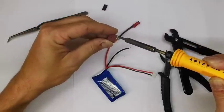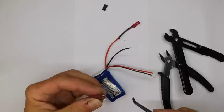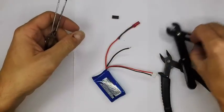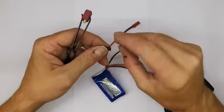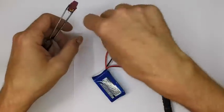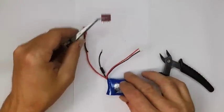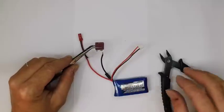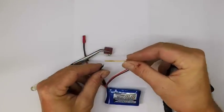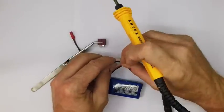Here's where your helping-hands tool comes in. I'm going to attach the negative first, and you'll need a little bit of heat shrink tubing. You cannot skimp on insulating with LiPo — or any pack. Heat shrink tubing starts fat and goes thin as it shrinks, hence the name. Slip a bit over the end before soldering. You cannot use hot glue, e-tape, or any substitute — spend the pence or cents to buy proper heat shrink. It's not a nice-to-have, it's essential. If you don't have the right materials, wait and order them — that way the job lasts and nobody gets hurt.